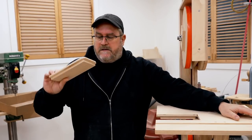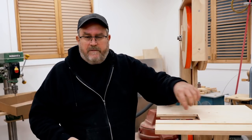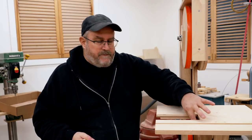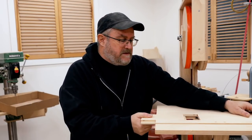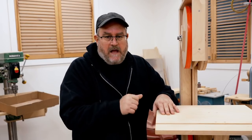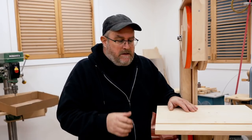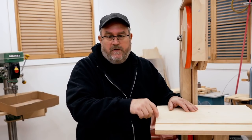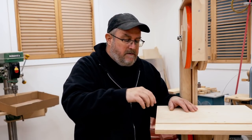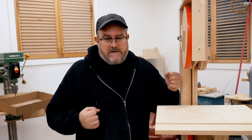The benefit of this is that you don't need to take the table off or try to wiggle the blade through a slot, and you can also get at the lower blade guide without messing around — it slides in and slides out. At this point I don't think it needs anything to lock it in place, but we'll see after I've been using it. It could just be a small number six screw from the top that locks the insert in place, and you take it out when you need to change the blade or readjust the lower blade guide.